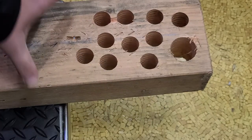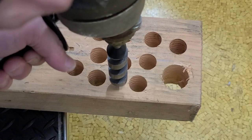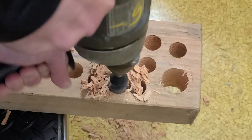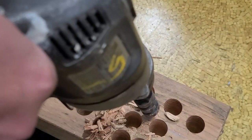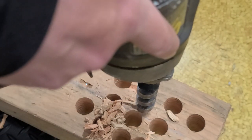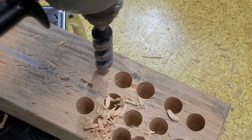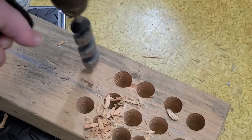Drilling a couple of holes with a one-inch auger bit — this could probably handle a bigger bit, but it's still disappointing that they only put a 4.5-amp motor on this; they should have put a 6-amp. You can hear it bogging down. I just did a video on the DeWalt DW222 — 6.7 amps at 1200 RPM with an excellent bearing setup — and surprisingly, this drill at half the RPM seems to bog down just about as much, because the 4.5-amp motor is adequate for a 600 RPM half-inch drill but isn't great, and those sleeve bearings are sapping some of the power.